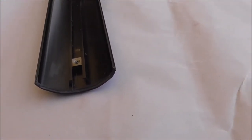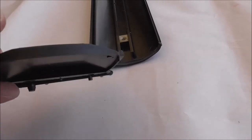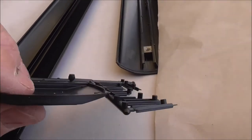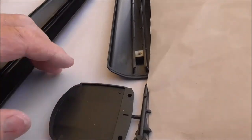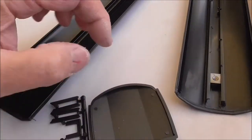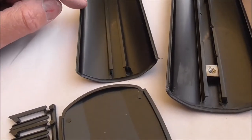While I talk about the roof, I actually want to talk about the ends. Notice how thick that top is on this end from another coach I haven't even started yet. Here's a roof from another coach — a pristine roof. If you were to put that on, it won't sit down because of the thickness. What I've done is, with almost a peeling action — I shaved it off with a Stanley knife from inside and then put a chamfer on it.